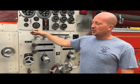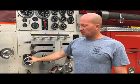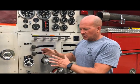If you do it too fast, you'll more or less go past where the pressure relief valve will catch and then you'll be operating at pressures above what you need. You still want to operate at about 100 PSI on one line, about 130 PSI on two lines. Make sure your pressure relief valve light comes on, signifying that it's doing its job — that way, if two firefighters are running two lines and one shuts their hose off, it doesn't throw all that pressure onto the other firefighter. It catches it and keeps the pressure right where that firefighter needs it.